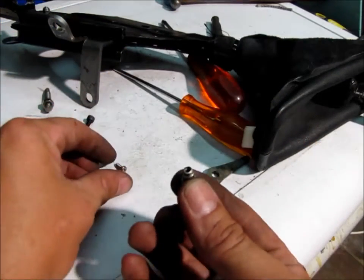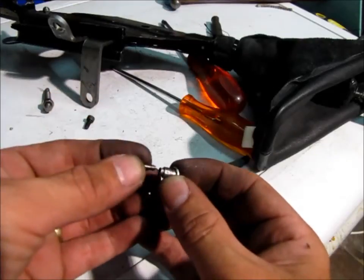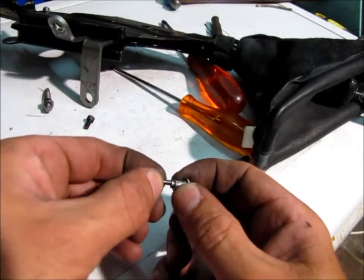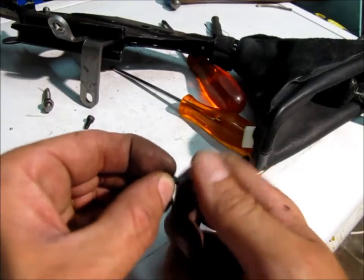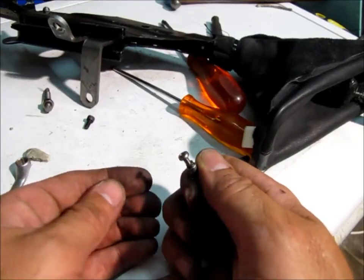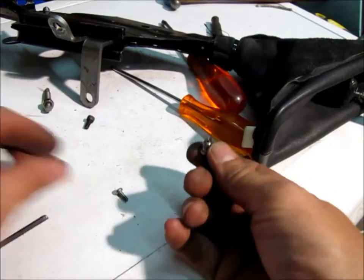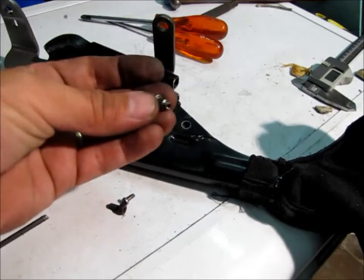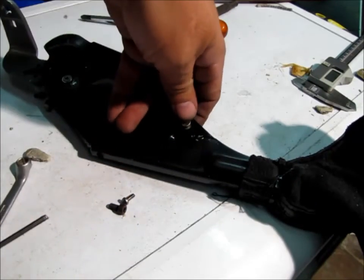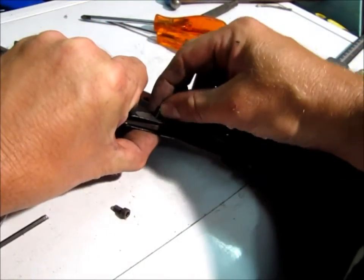To overcome my problem with the damaged pin, what I've elected to do is tap the end of the pin. I've used an M3 screw — there's a 3.6 shaft, a bit marginal. Not on center, not in a lathe, just hand drilled and tapped. That'll be enough to hold this pin in place. Take that, put it in there, and put the screw on the other side.